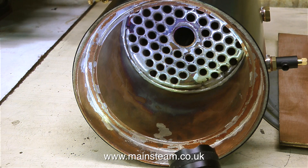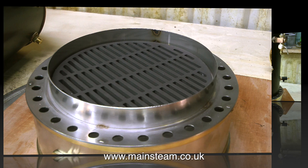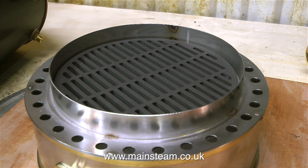As soon as I've finished this mounting base, I intend to do a coal-fired test of the boiler, but first of all I'll fit a hand-operated boiler feed pump. Normally for a coal-fired boiler, you are required to have two methods of putting feed water into the boiler — one is the hand pump, and in my case the other one is going to be an injector. But for this first test, and owing to the good design of the V6 boiler whereby the boiler can be lifted off the fire if you get a problem, it will be fine with just a hand pump for starters.